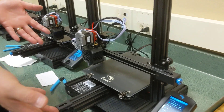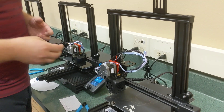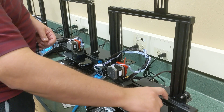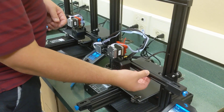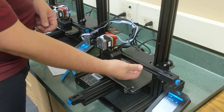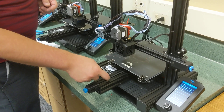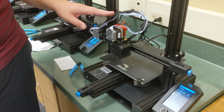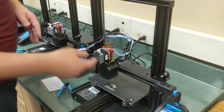While this is heating up, here are some important parts of the printer. This is the extruder motor — there's a gear in the back that pushes the filament through, and the software tells the motor how much to push. This is the carriage that goes back and forth on a belt connected to a motor. This is the X-axis carriage and belt. This is a belt tensioner — the belt is a little loose so I'm going to tighten it so it doesn't move more than about an eighth of an inch. You want your belts nice and tight, because they translate the motor's motion to the carriage's motion — a perfect one-to-one ratio.